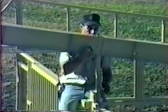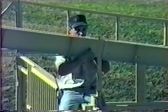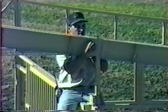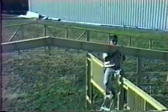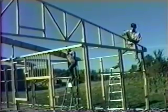Now let's put a center rafter over the aisle. Again, it goes from aisle post to aisle post. 4 bolts hold it in place. Let's put another end rafter up so you can see how easily it goes. Slips down in place. 4 bolts hold it there.